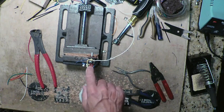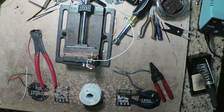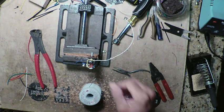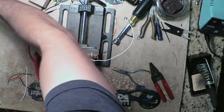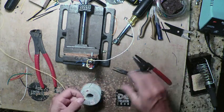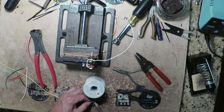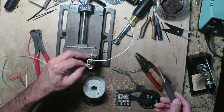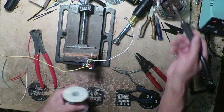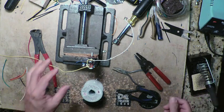This particular wire here will go back to the board. So we're going to need to grab some yellow. Right, so this is going to connect back to basically the tone stack, right at the junction of the treble capacitor and the 33K slope resistor.